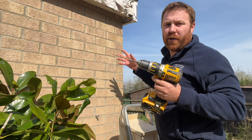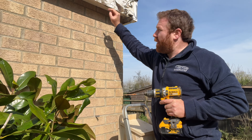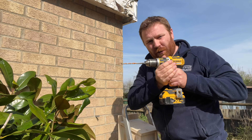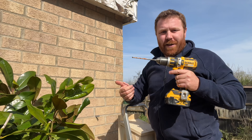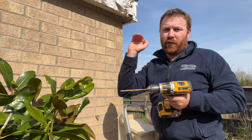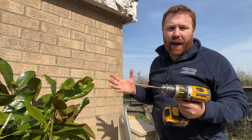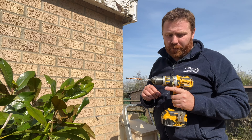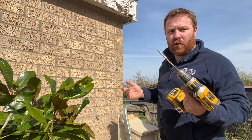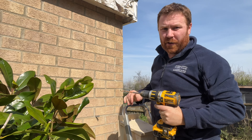Now I'm going in straight with my 7mm drill bit. If you've got particularly hard mortar you can use a smaller 4mm bit first, so you're not forcing the drill. The hammer setting really helps — it acts like a pneumatic drill, knocking into the wall as it drills, so it goes in a lot quicker. You don't have to use the hammer setting though — you can just drill normally, it'll just take a little bit longer. I'll demonstrate both sounds for you.